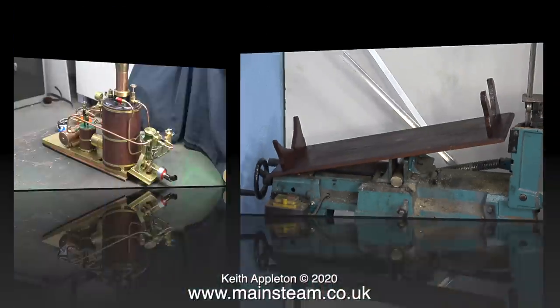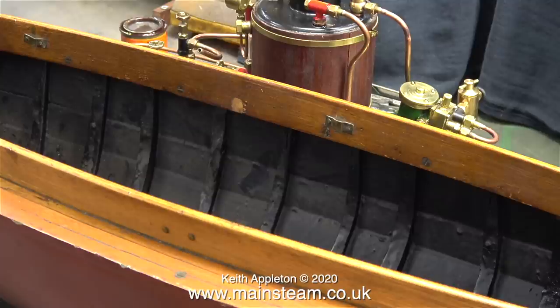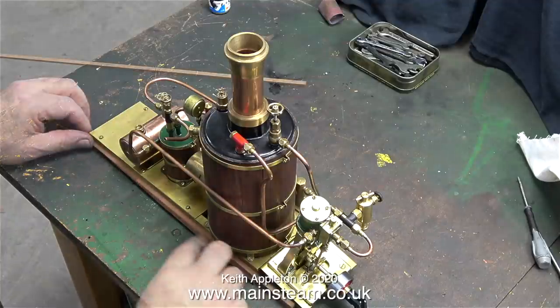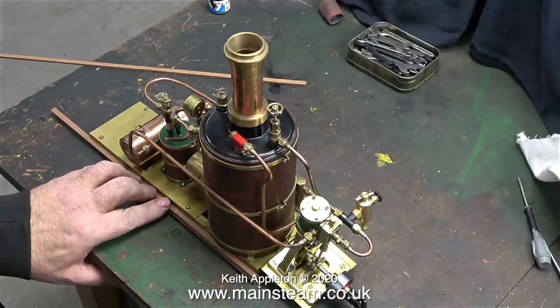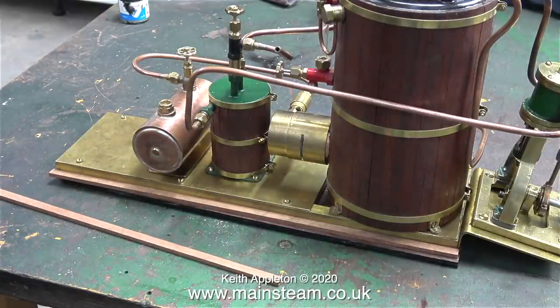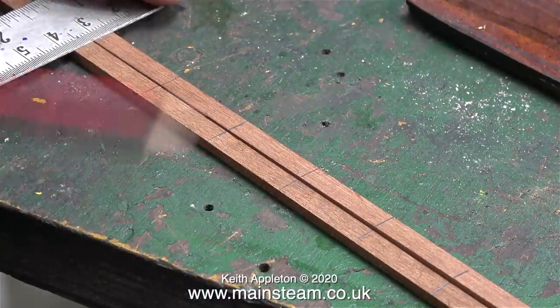I'll come back to this job in a future episode. The mahogany plank floor on top of a piece of plywood needs some side rails to locate the steam plant in the correct position once it's all together in the boat. I think I've figured out a very convenient and quick way of mounting the steam plant. Once I've perfectly aligned the steam plant with the propeller shaft, I need to make sure that if ever the plant is removed from the boat it can only go back in the same position. I'm going to use two pieces of mahogany, one at each side of the plant, then trim the base before fitting the completed wooden base into the hull itself — in a similar manner to which the boat has been built.